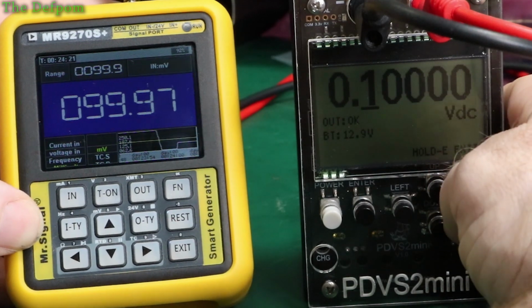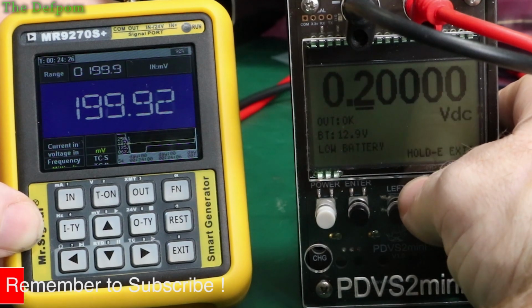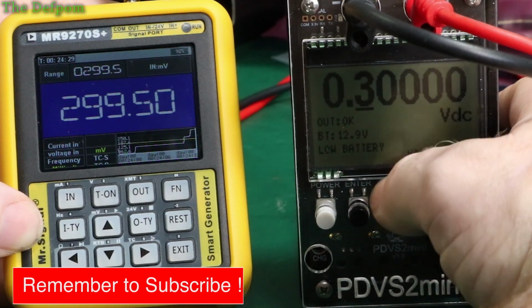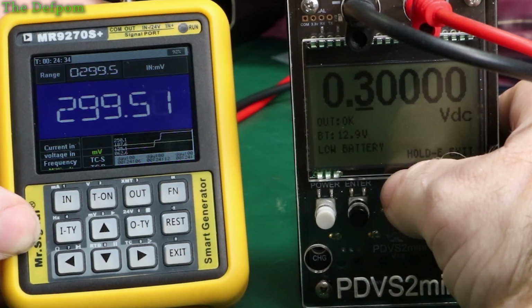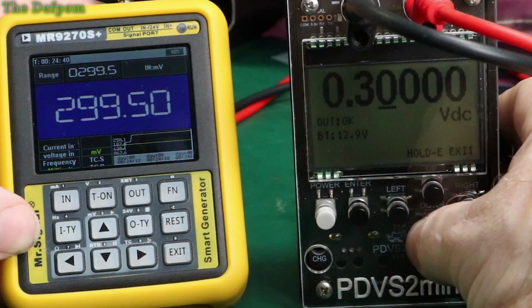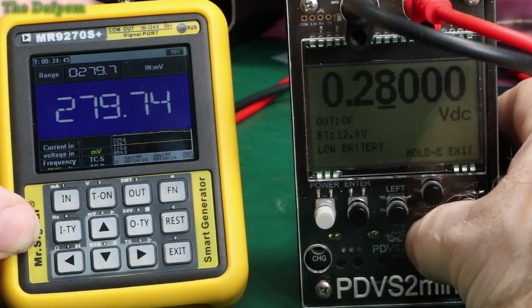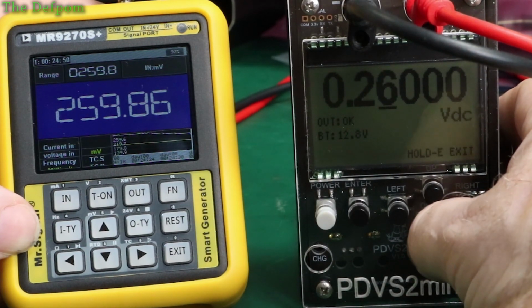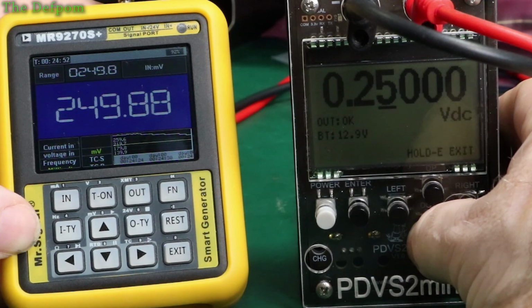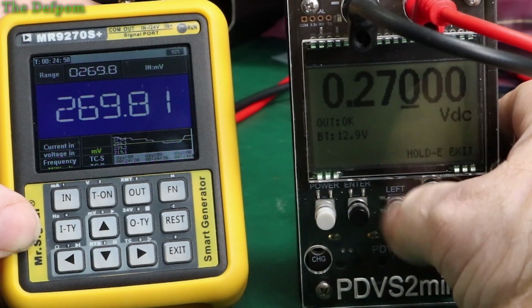So there we go. So that's about 30 microvolts out in comparison. If I do it closer towards full scale, which should be 300. There we go. There's 500 microvolts out there. And obviously the noise in these cables is affecting it too. So I'm going to see if these stay linear. So there's a slight step there. It stepped up slightly by a little bit. Yeah. But it's not bad. Yeah, it's not a dead linear response on that. It's each one stepping slightly, but that's okay.